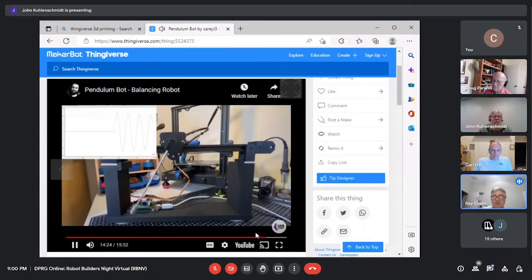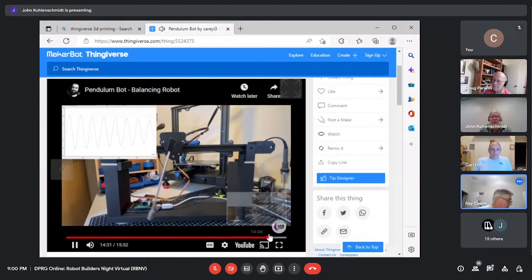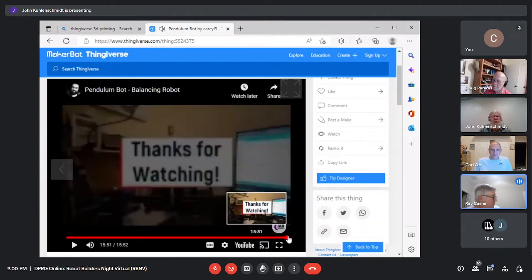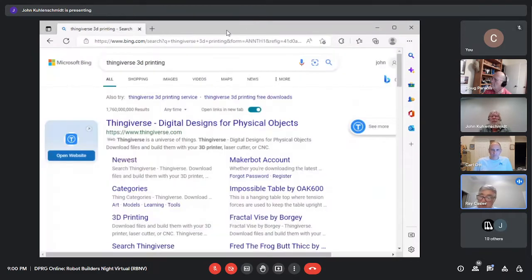Actually, with the I squared C stuff, in my case I have the GPS unit, the color sensor, and the BNO 055 all on the I squared C bus. And each of them have terminations that I haven't messed with. It's running at 100 kilohertz. I haven't looked at any waveforms. Knock on wood, it's still working. They'll probably still work. Good enough.